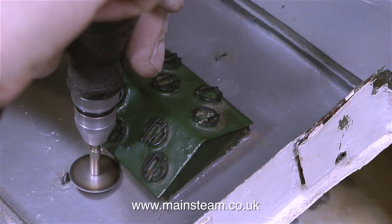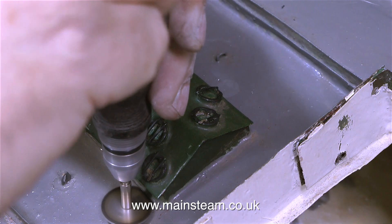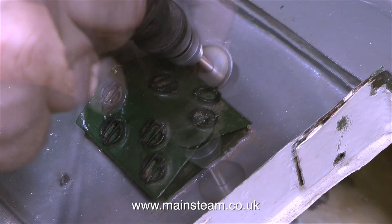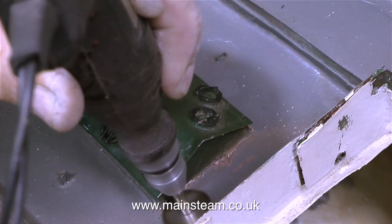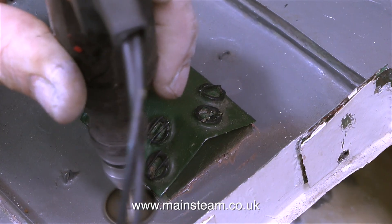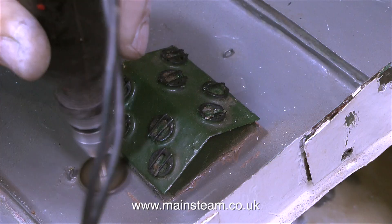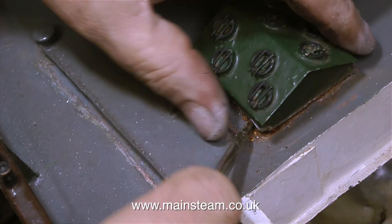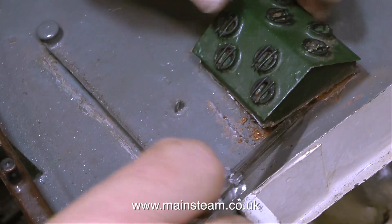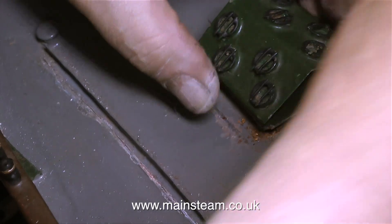This next job is not the nicest I'll ever do. I need to remove this part and cut a hatch below it to fit a servo to operate the rudder. Please note this is not a grinding disc — it's a small metal saw. I'm using this so it doesn't scatter lead everywhere, because I'm cutting through the solder not the steel. Usual health and safety warnings: this is lead and the paint may have lead in it, so apart from wearing eye protection wear some sort of breathing mask. It came away very easily by levering it off with a screwdriver.